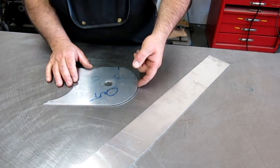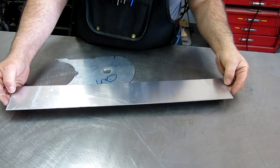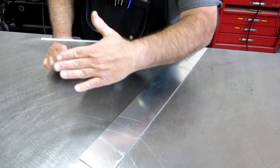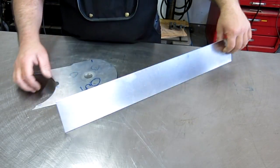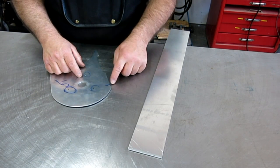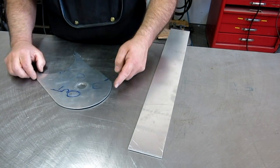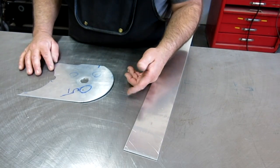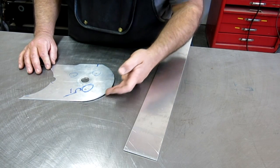So we've got this all cut out now. My friend Marty sheared me some strips. I need to make the curved side piece that will make this into a three-dimensional cover. As you can see, we've got a straight section, then we have to form it around this curve, and then there's a little bend here, and then it kind of ends here at this mark. I marked this on the machine over there - that's kind of the end of the guard.